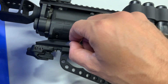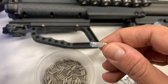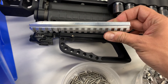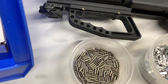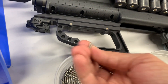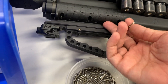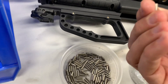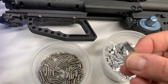You have four of these bars and eight set screws, which is an extreme safety precaution. When you lock in all eight set screws with those four safety bars, the whole thing pushes up and locks into place. If you only used a screw, it would dig into the plastic and after a while it would start to shake back and forth and actually ruin the plastic Picatinny rail. So we don't recommend anything with just screws — that's why we went the extra mile and included four locking aluminum spacer bars.